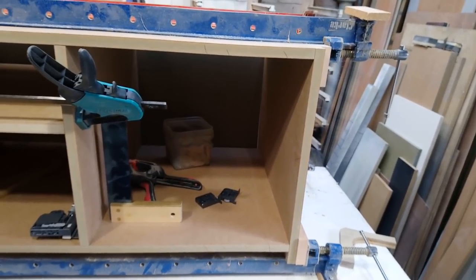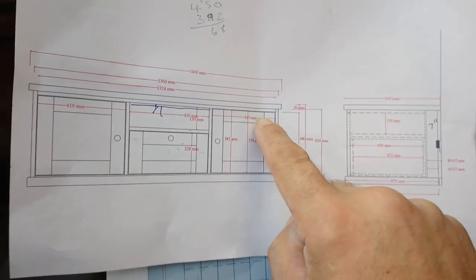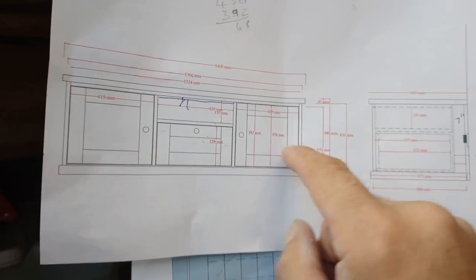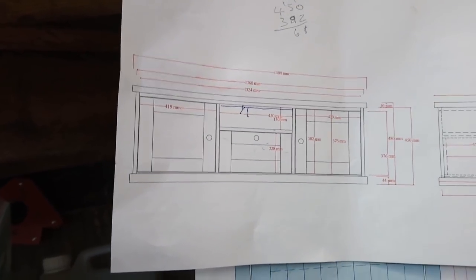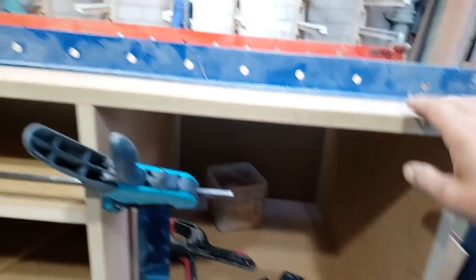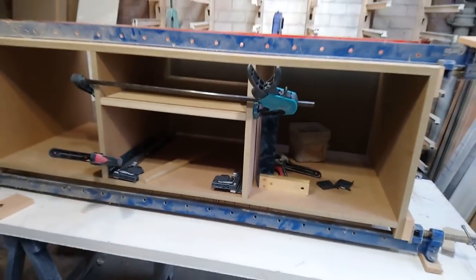I showed on my kitchen, I think it was, that in order to get two dominoes in the top of the frame of the doors, see here, to get two dominoes in there, these timbers need to be about 80 mil. I don't want them that far. I want them about 70 mil, which is what I drew on here. This has been approved, so that's what I'm going to make them. So anyway, they're pretty straight. I'll get a straight edge on the top of there and just make sure that these are as square as I can get. I am wondering though